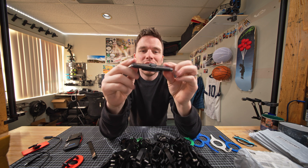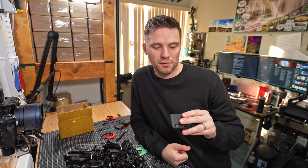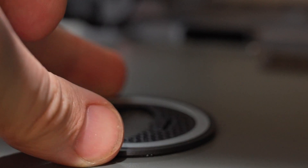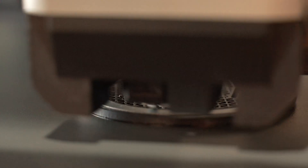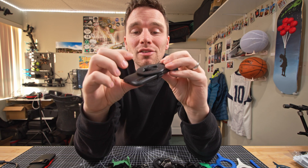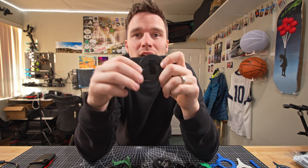It's simple, sleek, elegant, light and strong, and it will work with every type of SSD I've tried — and likely any normal-sized SSD. With the larger strap, you can fit two or three on top of each other. The major breakthrough in these newer versions was transitioning away from having an additional part that clicks in, to creating one final product. I started printing up until the height of the top of the magnet, then dropped the magnet directly into the 3D printer — it magnetized to the bed and printed right on top, creating one super solid piece. Thankfully Bambu came out with TPU for the AMS, and I've been testing TPU base and top layers so it's softer to the touch, but still has the strength and rigidity of PETG as the intermediary.